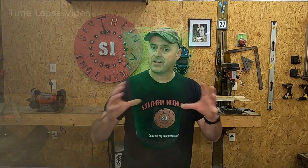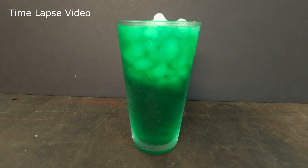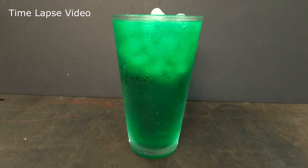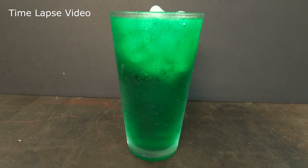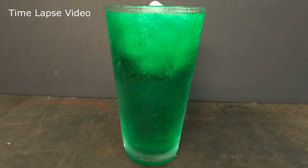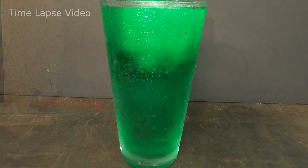For those wondering how water gets inside the tank in the first place: we've all seen how water droplets form on the outside of a cold glass on a hot day. That's because there's water vapor in the air itself — it's called humidity, and it can vary based on changes in air temperature, air movement, or the proximity to warm bodies of water in your area. As this warm moist air comes into contact with the cold glass, the air temperature cools down to a point where it can no longer hold that moisture, and the water vapor condenses back into a liquid, forming those droplets. So as your compressor is pumping outside air and compressing it into that tank, the same thing happening on the outside of that glass is happening on the inside of that tank.